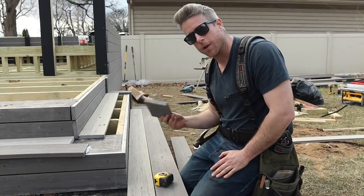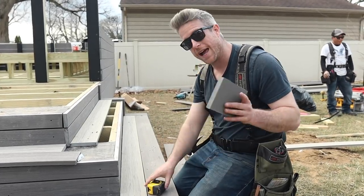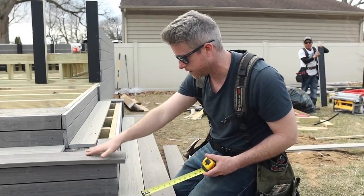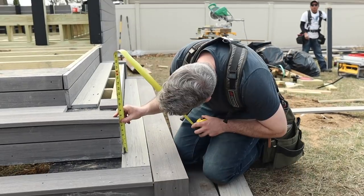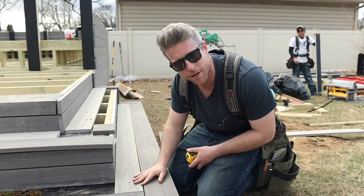So I can cut my long point on a board, hook that, measure back 79 inches, cut it, should fit right in here. And because I wanna be efficient, I can measure this leg as well. Have this scrap here, you know, I'll use this. Got 7 5/8. So I'll cut both of those, get them up here, and should fit like a glove. Then we'll lock it in for justice.